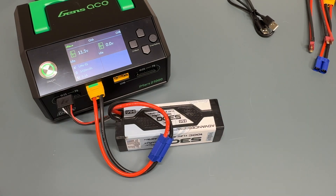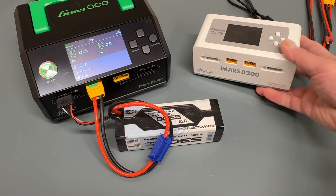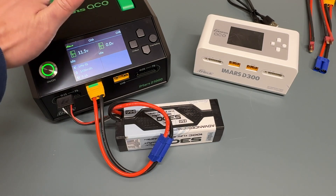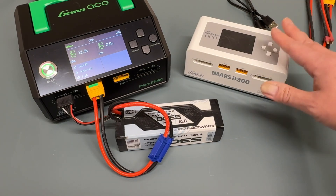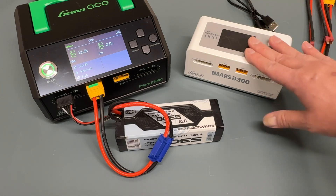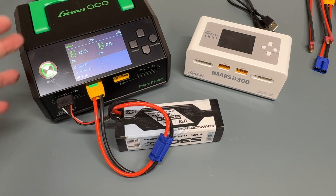If you're running six or seven cell packs in the 8,000 to 10,000 milliamp hour range, then maybe you want to pick this thing up. It's obviously quite a bit bigger and a little bit more expensive, but it is a hardcore, super heavy-duty charger — really, really nice product. I've had no issues with the D300 — I've had two of them — and lots of people use them with great reviews on YouTube, Facebook groups, and the forums. This is an excellent charger, and one step up is the D1000: way more wattage, way more power. You can charge those higher cell counts at higher amps if you have a higher capacity battery. To be safe, always charge at 1C — pretty much every battery supports that — and always refer to your manual for what your specific battery supports.